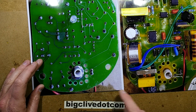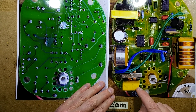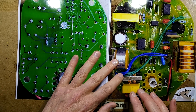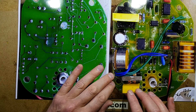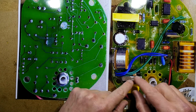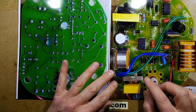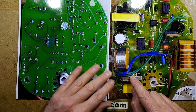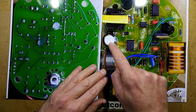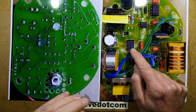We've got the two-pin fuse down here, and then we've got a suppression capacitor — a little X2 suppression capacitor — and a common mode suppression choke. The choke is designed so that the low frequency mains coming in can easily get through, but any noise trying to get back out at high frequency counteracts itself — it creates a magnetic field in one direction counteracted by a magnetic field in the other — fitting a lot of suppression in a very small area. Then we've got a bridge rectifier and a big smoothing capacitor.